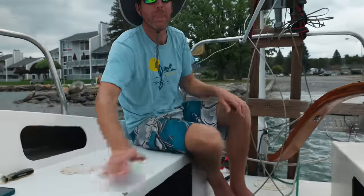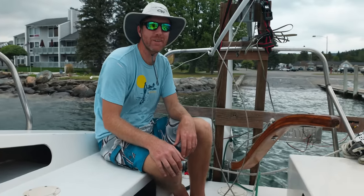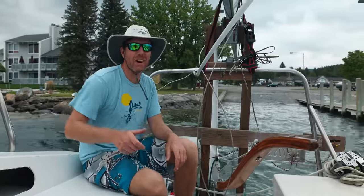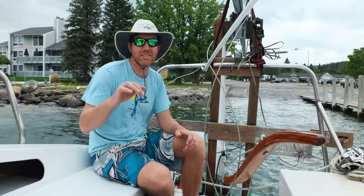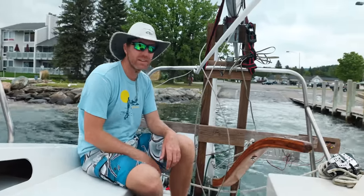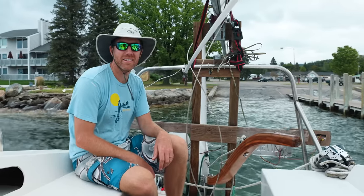How awesome is this? Can we just throw back to our day on the river? Yeah, but this is a completely different issue. The fuel line on the Tartan was turned off. This fuel line just wasn't seated properly, and so some air was getting in and the suction wasn't sucking up out of the fuel tank. So in both cases, it wasn't getting fuel.